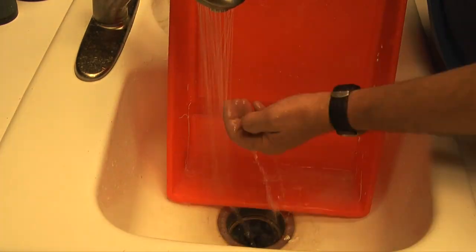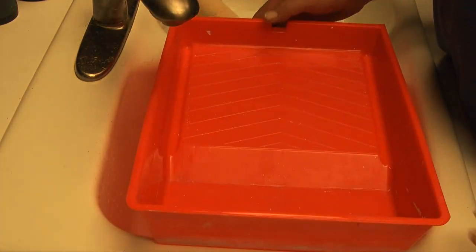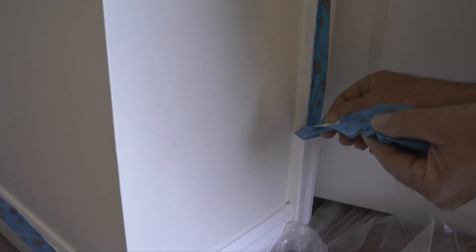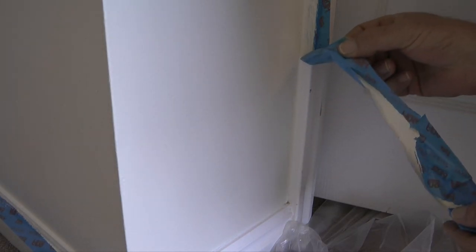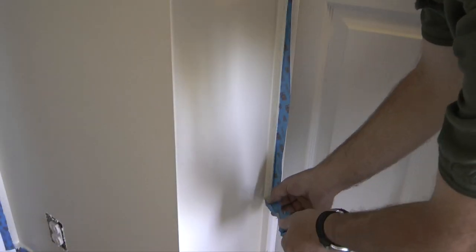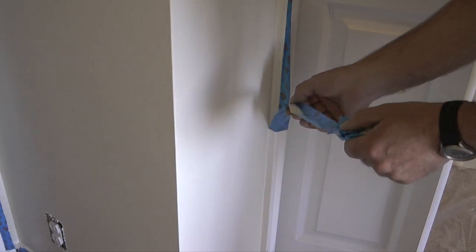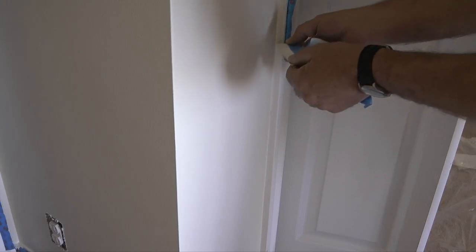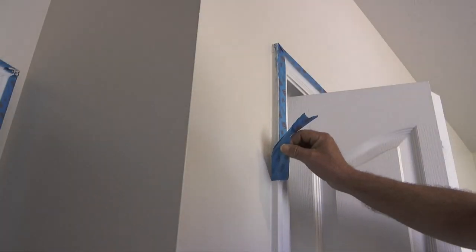With the cleanup finished and when the paint dries, I'll remove the painter's tape. To remove the tape, I'll pull up on the tape until it is perpendicular with the still-applied tape. Notice how the tape forms a C shape and cuts the paint as I remove it — removing the tape this way cuts the paint line cleanly.